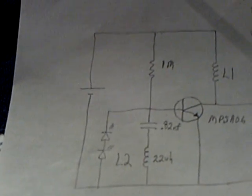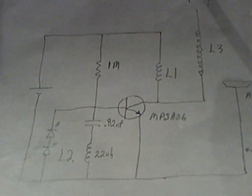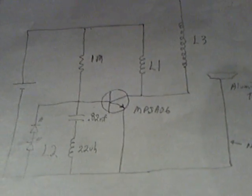And it worked. It is incorporated inside the L3 coil, which is this coil right here, and the circuit is a Dr. Stifler circuit with modifications. Johnny Devereaux did some modifications to it, and then I've been modifying it, as has Slider, just to experiment with what can be done with an exciter circuit. I've added a variable capacitor right here, went to a regular choke here, and the L1 is inside the L3.